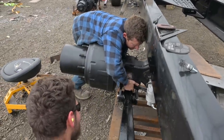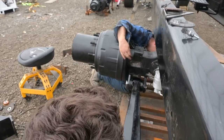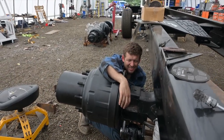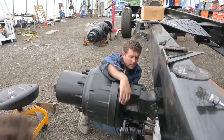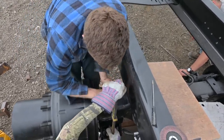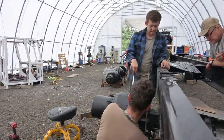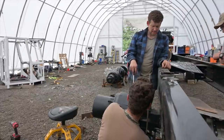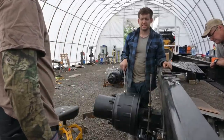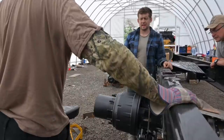Good news - push her in a little, we're just on an angle. It's higher than it was before - it's going in. Why is it stopping? Because I'm bottomed out, I can't drop this to open it up any. Now we can beastie clamp it up. We'll need a wrench eventually but we don't know if we're centered because we may need to be a little left or a little right. If we tighten it all the way in it'll be a pain to knock it off. Leave the fine tuning at the end because we'll probably need some minor adjustments. If we put the saddle on, bolt the saddle in, then tighten this up to the saddle.